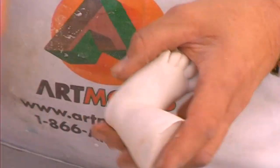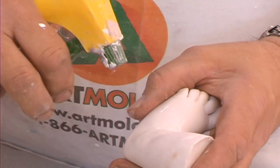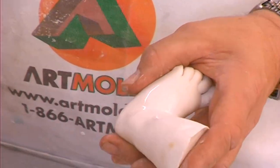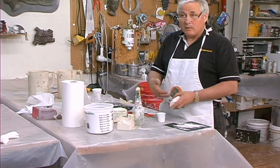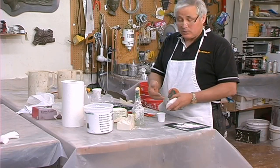Spray some water on the piece, because plaster once it dries really likes to soak up water and it will soak the water right out of the new plaster if you're not careful. Put a little bit of plaster in place and smooth it out. With just a little practice you can repair things - you can even rebuild fingertips and fingernails if you have to. That little spot will pretty well disappear. If you've got it wet enough, that plaster will go ahead and get hard again. You can use little dental tools to clean that up, or hobby-type dental tools you can purchase at any hobby store.